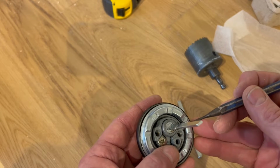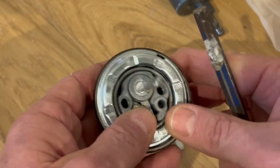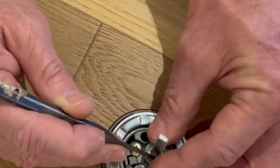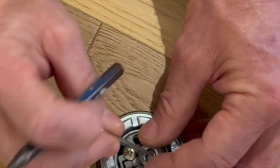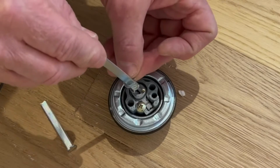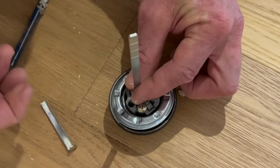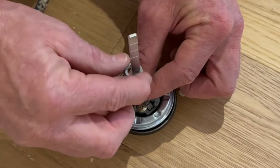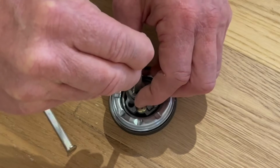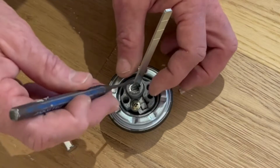And if you see, there's a little brass pin right there, and you can push that thing in, and that allows you to unscrew this and get that thing out. You gotta kind of hold it down with one hand and unscrew with the other, and then see, that comes out. So once you've got that apart, put this C-shaped clip on there, so the notch goes on that brass pin. Hold it down there, then take this ring that you unscrewed, put it back on, and then just screw it back on. You know, reverse the process, pushing this thing down while you spin it.